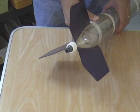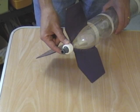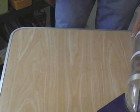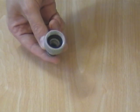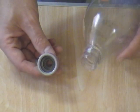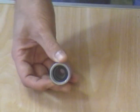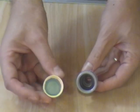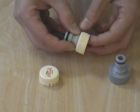Today I'll be showing you how to make one of these water rocket nozzles - it's called a 9mm Gardena nozzle. You can buy these garden hose adapters from your local hardware store. The problem is the thread is different from a standard bottle, so you can't put it on. Essentially what we have to do is replace the thread from a regular cap and turn it into one of these.